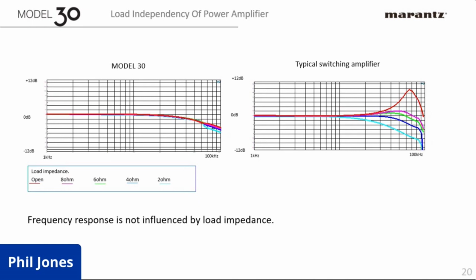Yeah, that's correct. So I would say, yeah, it is a lot of value for the product, and I think there's been also a lot of progress that has been made around, I would say, digital amplification. So I know that sometimes people may have a reaction of saying, "Oh, this is digital amplification," but as you mentioned, Gene, there's been so much progress in Class D amplification that it is now at a level which is almost impossible to notice any difference between a Class D amplification, the way we do it, or what you're going to have in an AB class.